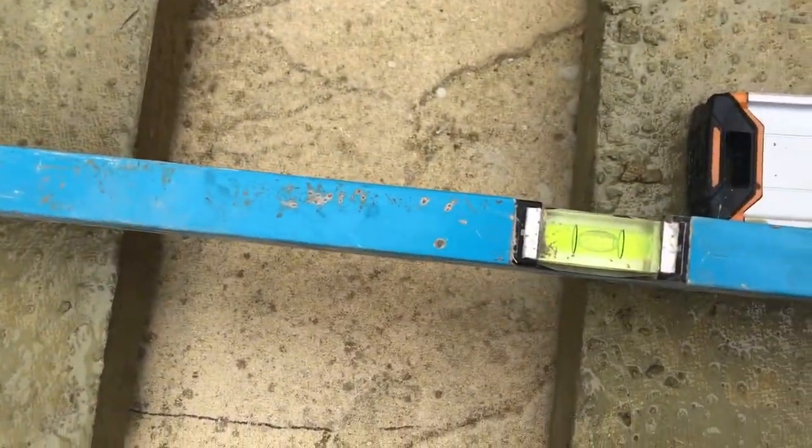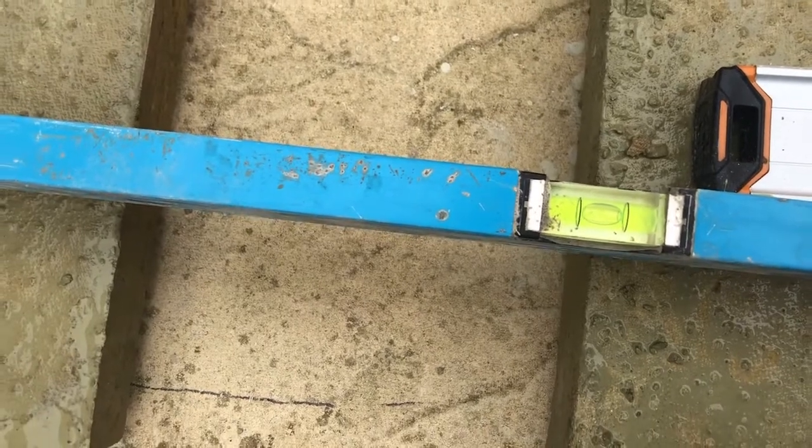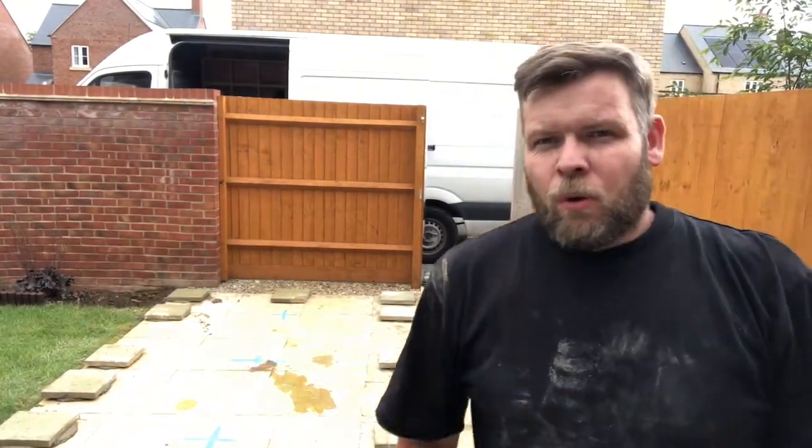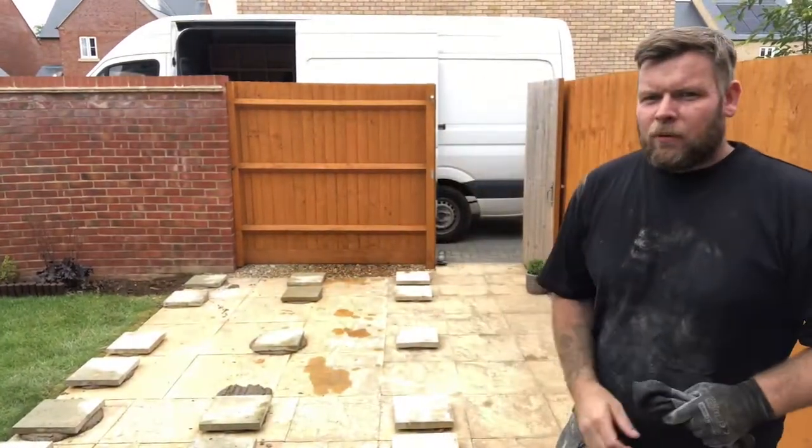And then across both piles, we're just using a longer level to level off all the way round. As you can see now we've got all the outer edge piles done. What we've been doing is leveling it with the boat level, making sure it's level all the way round and then leveling it with a long level on each pile, twisting the level around each time you move it just in case you're that one mil out — you can then raise it up. So now we have all the intermediate ones done.